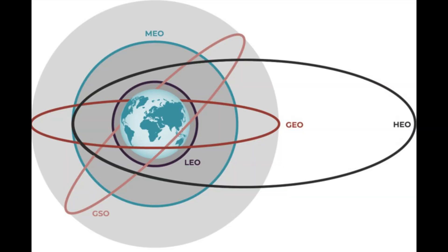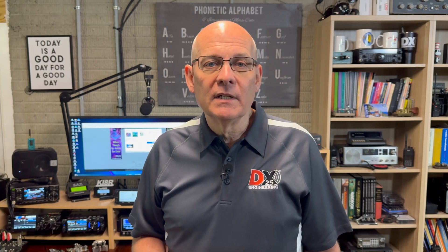Satellites are classified by the height of the orbit they're in, which determines the kind of coverage or footprint that a satellite has. LEO, or Low Earth Orbit, has a range of 160 to 2,000 kilometers, or 100 to 1,243 miles. This is where you'll find most ham radio satellites today. LEO satellites are cheaper to launch; however, they cover a small footprint. They take about 90 minutes to orbit the Earth, giving you about a 10-minute window to make a contact. The actual time of a pass will vary depending on where you are in relation to the satellite.